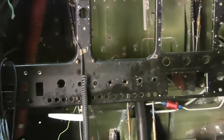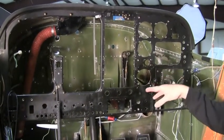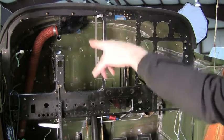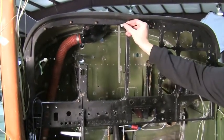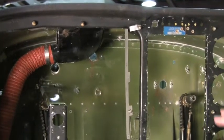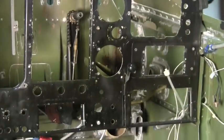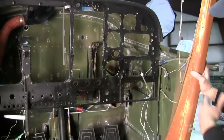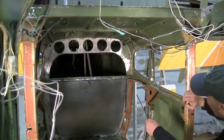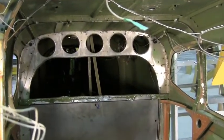It's all going to be redone — all brand new. Scat tubing, insulation, the firewall, and the ceiling are all going to be completely redone. This panel is going to be all redone. Essentially, we're going to have a panel fabricated that attaches to this panel. The pilot's panel is a floating panel for the flight instruments — it has isolation mounts. The other is a fixed panel; it's actually a portion of the airplane. We'll be clearing this out to accept our new instruments on a fabricated panel attached here. Looking at the rear of the cabin compartment, we've removed the baggage area and the battery box and gone in and completely redone that.